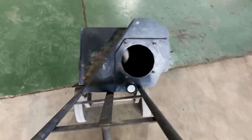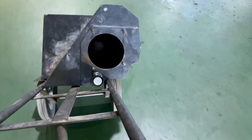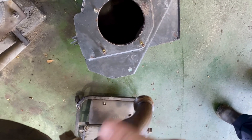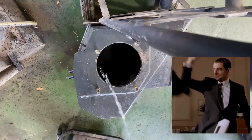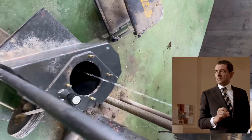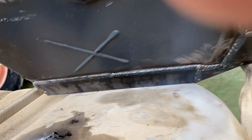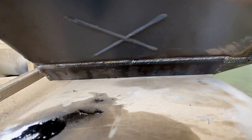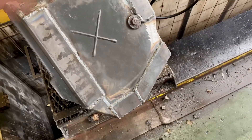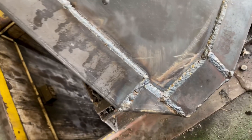After skipping the second welding part, it's time to leak test it. Always use your head. That looks pretty good — no wet spots. The reason I use diesel instead of water is that water can contaminate the hydraulic, so diesel is easier to get out. Leak test passed.